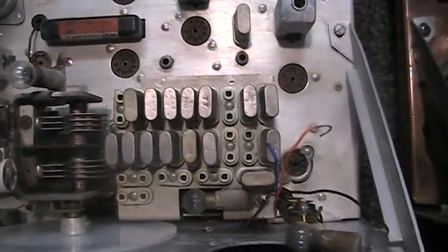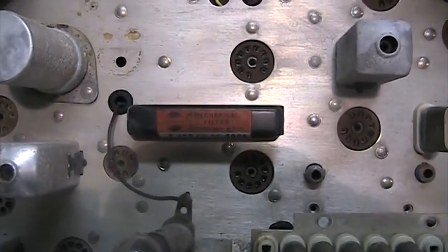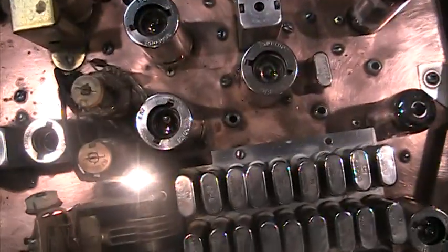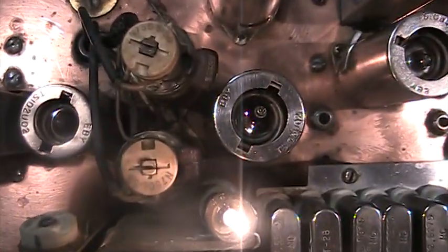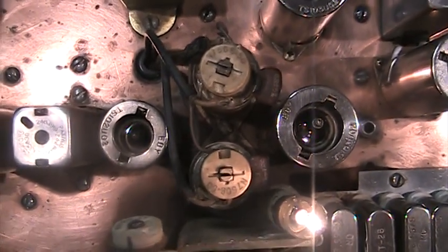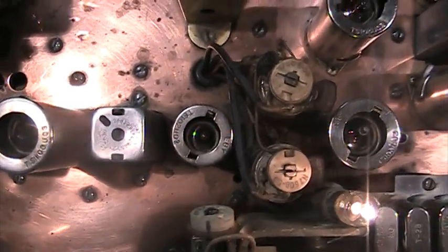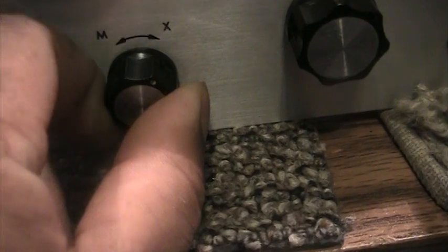There are a few other differences. Probably the biggest and most obvious one is that all other Titans have a Collins mechanical filter — that's rectangular — sitting right there. Whereas this was sold to me saying it did not have any Collins filter. In the picture I didn't see any, but those two guys right in the middle of the screen are two cylindrical Collins mechanical filters — one for wide and one for narrow — kind of like a Browning R27S23, which has a wide/narrow switch. This one also has a switch that's labeled as part of the crystal receive switch: wide, narrow, and crystal.